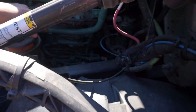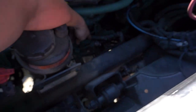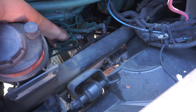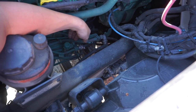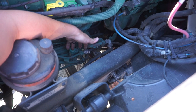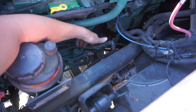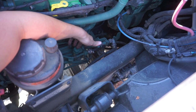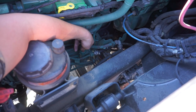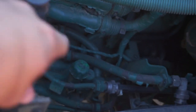If that happens, you've got air in the system. So what you have to do is come down here to this little knob — you push down and turn counterclockwise and it pops up. Then all you have to do is push it. The book says push it three times and it should be fine, but if it's got that much air in the system you're gonna want to make sure you're doing complete pushes. This one probably takes 25, maybe 30 times to get all that air pushed out of there, but you'll feel the plunger itself start to get hard. That's how you purge the system.